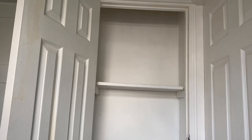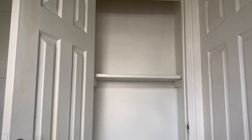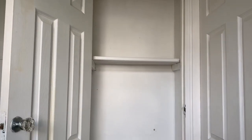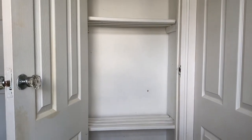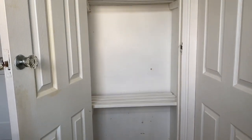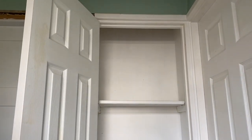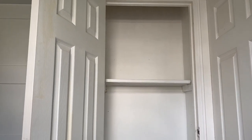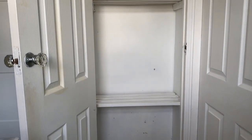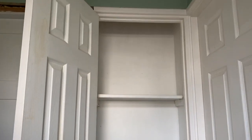I'm going to treat this video as I would in a customer's home. I would come to a job, see this opening, take some measurements, go away, draw up a 2D drawing with a price. If the customer agrees, I would come back, do the demo work - take out that bulkhead, take out the lining - then take some better measurements, go away, start building the cabinets. That's the step-by-step process I'm going to show you.